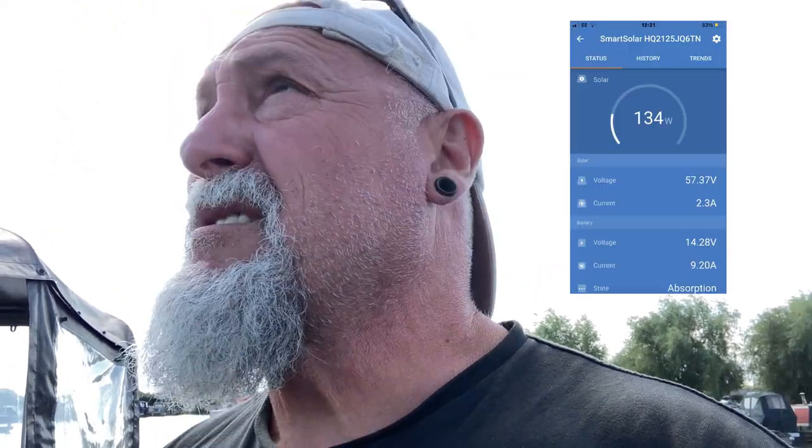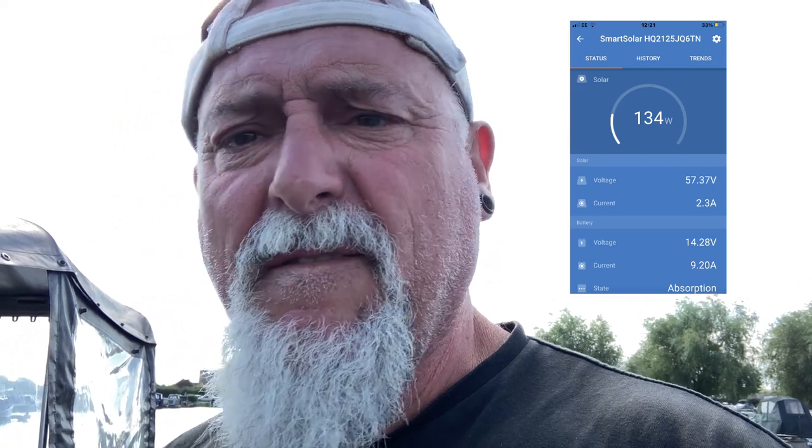So that's me just about done, really. I just need to check the configuration of the MPPT controller, which we can do on the smartphone. They're all pretty much smart now. I'll ping you a screenshot of that here somewhere, which shows you the yield. Obviously the batteries are charged now, so you're not going to see full yield, full current, because the battery's already full. They've been on charge all day. But yeah, that's about it. Put the conduit in when the customer's painted his roof.